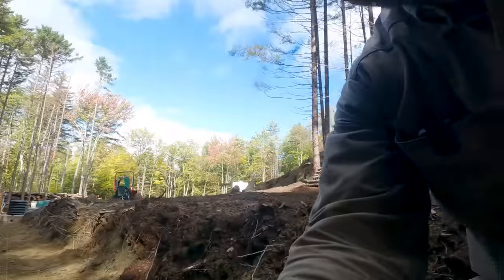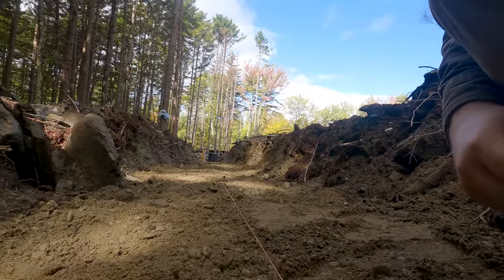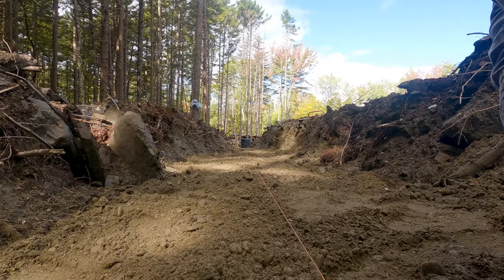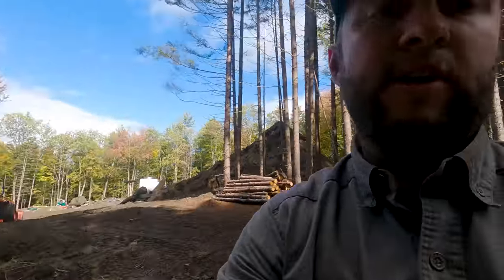So you attach it to the mason line and it kind of hangs. But after the plate compactor, we'll come back with a laser level and just really make sure that the slope is right. Yeah, it's really hard sometimes to gauge. Like, you sort of look down the line here and it's really hard to tell, is that level or is that sloping or what? So rather than going by eye, we are going to use technology to tell us. So the line level is a good start, but the laser will be our real truth test.